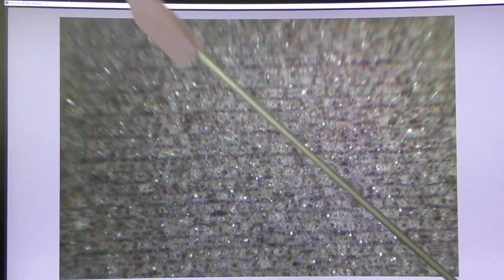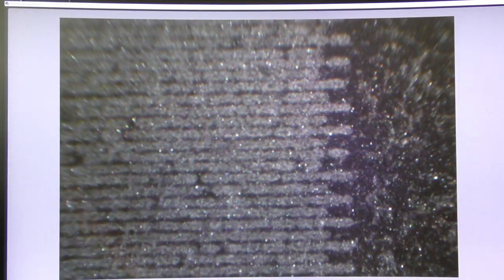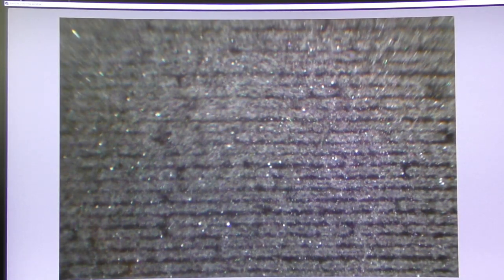Now there's that finely textured bubble surface at 100 millimeters a second, 15%, where you can clearly see some scan lines. Then we go up to 400 millimeters a second, where we're running very fast. The scan lines have dropped right down in size and got thinner. So we're seeing more of the background through the scan lines, which gives the impression of maybe a grey, because we've got a mixture of white and black, which your eyes see.